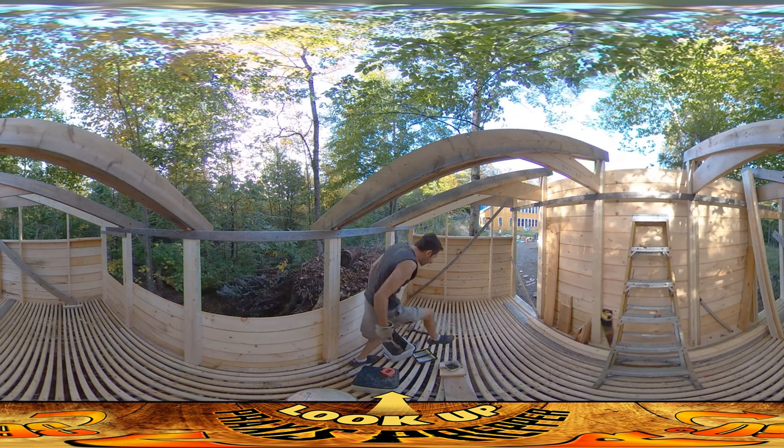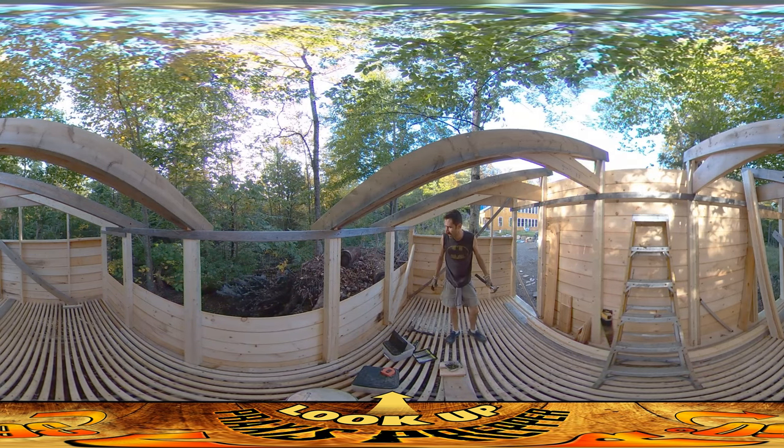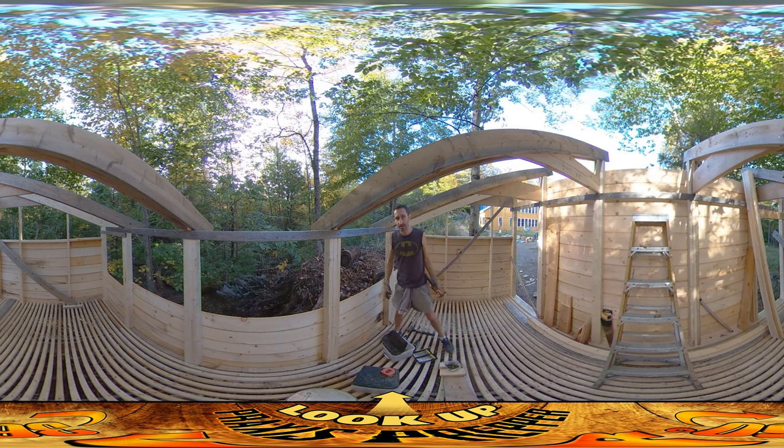This is going pretty well. I think within a day or so — not even a day — I should be done with all the walls. Then I just got to finish the roof. I'm going to finish up the roof with five runs of 2x4s every two feet. I decided to do that instead of wall boards for the roof because I ran out of wall boards, and also the 2x4s for new material would be cheaper. It will also be stronger because it's inch-and-a-half boards instead of three-quarters, and it'll give a little bit of extra headroom — an extra inch and a half. It'll be strong and it'll work well.